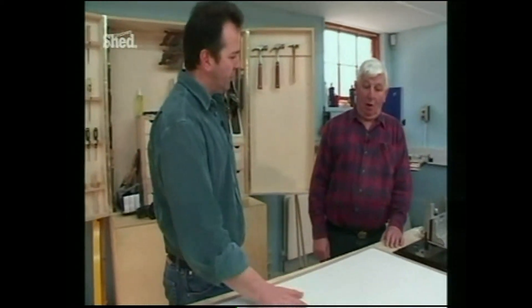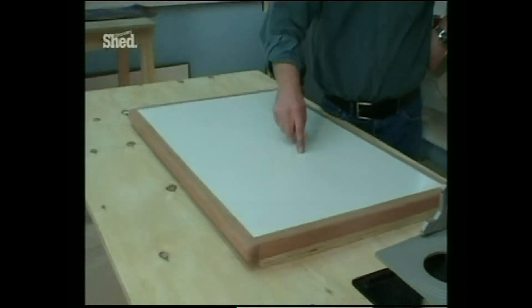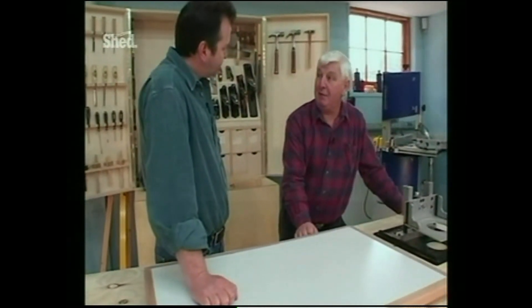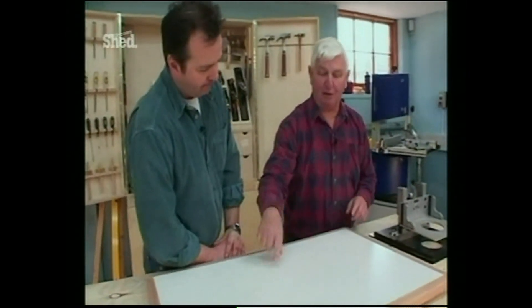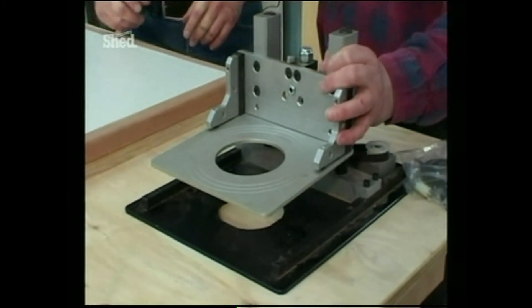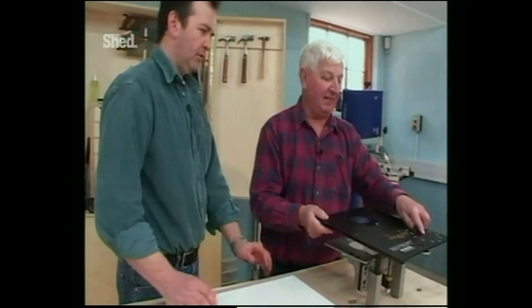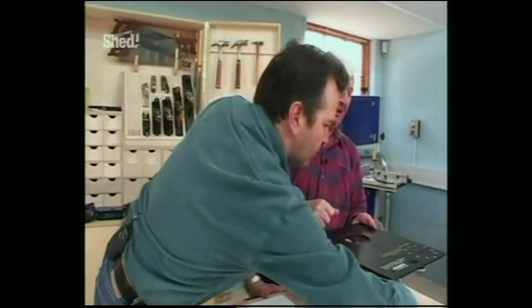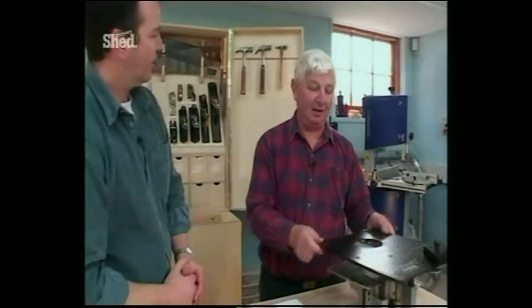So what options are there for us to do this? Well, the first and easiest would be to bolt the router straight underneath the table with a hole for the cutter to come up through, but with 18mm you're going to lose depth of cut. The next common method is to have a plate set in the top — might be plastic, might be metal, about three-eighths of an inch. A third, more sophisticated option is where we've got a three-sixteenths steel plate and the router is carried underneath, with a winding handle that very precisely takes the router up and down. And it overcomes one of the great problems of using a router table — having to get underneath it to change cutters or to set the height.